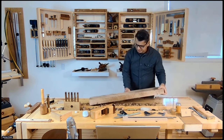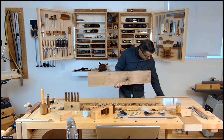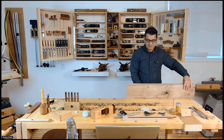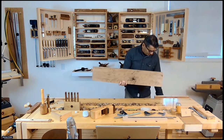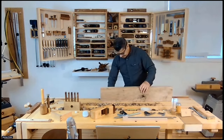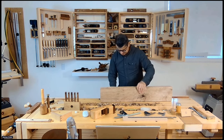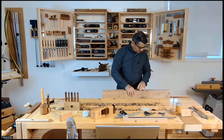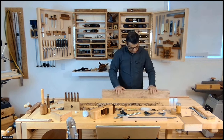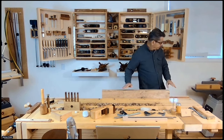I'll show you what it does now. So if I'm jointing this board, I've already determined the orientation and direction of the grain. This board is a little bit too long to just hold in the face vise, so because it has numerous holes, I can insert and remove dogs in the holes. I'll just set it to that dog. You want to use a long-sole plane when you're doing this — either a wood-bodied one or a metal-bodied one.